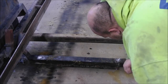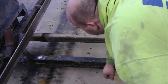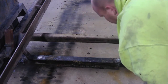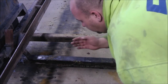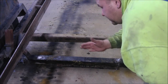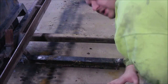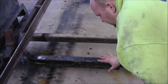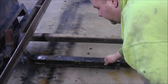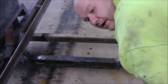Right there — big old crack in it that Hudson's dad tried to weld up. Did an okay job, lasted a while. He added a plate on the bottom; I think there's a crack somewhere in here too. He did a good job dressing it up. What we're going to do is slice this whole section out, add a piece in the middle, put some stubs in there, and cut it diagonally so it's not just a sheer cut. There's so much stuff attached to the end of this tube it'd be a pain to cut the whole thing out, so we'll just replace the broken section in the middle. This is where the chute rides, so it must vibrate and crack under a lot of weight. Trailer manufacturers use the lightest duty steel they can get away with, so we're going to add a nice big heavy chunk in there with some heavy stubs to reinforce it.